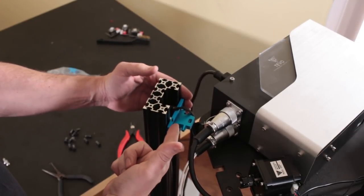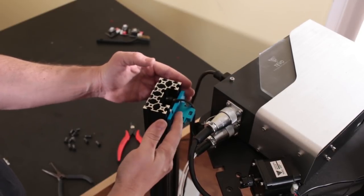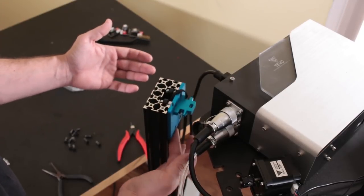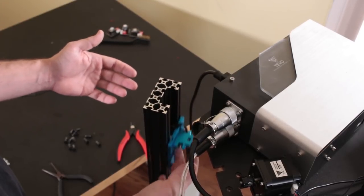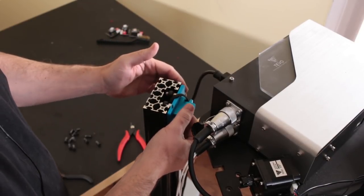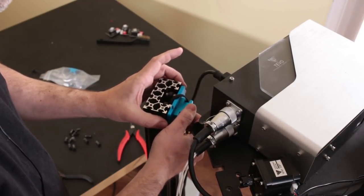Wow, I just did that a minute ago, you guys, off camera, and it totally did not work. So I guess there is enough adjustability in those eccentric nuts. If you do it right, you can get the slide. So that's where you need it. That'll totally solve the problem. Now what you want is for it to slide freely with no wiggle. And we can see I've got a little bit of slop.